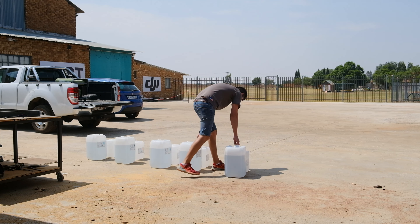Next step is cutting the slab down to its final size. I always mention this in my videos: during the planning process, always build your table slightly bigger lengthwise and widthwise so you have room for error. Also, make sure you change to a blade with a lot of teeth — it gives a very fine cut. Using the wrong blade will rip the epoxy and leave small pockets and scratches along the cut edge.